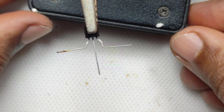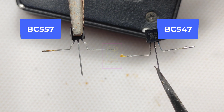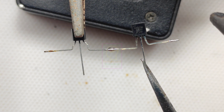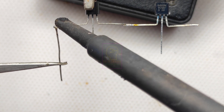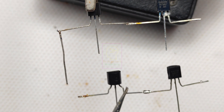In the future I will be making a dual axis sun tracking system, so please stay tuned to my channel. The complete schematic diagram is given at the end of this video. The circuit is wired around an H-bridge, which is commonly used for rotating a motor clockwise and counterclockwise. In this H-bridge, we have used a feedback from one rail and the other one is controlled by two LDRs.